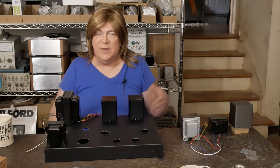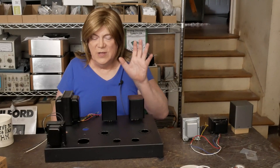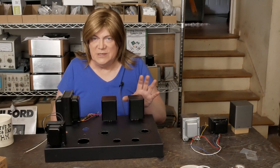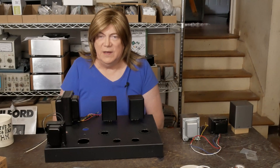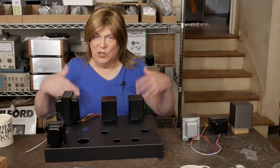I'm going to build the whole amp, but I'm not going to drill the holes for the transformers until I test these. What gave me a little pause is their fairly low inductance, as well as the frequency response curve saying they go from 45 Hz up to well beyond hearing range. The main concern is the low end.